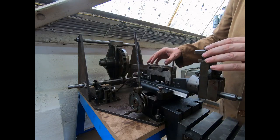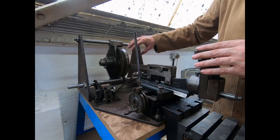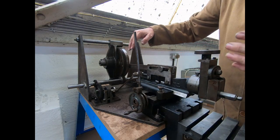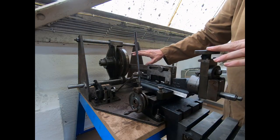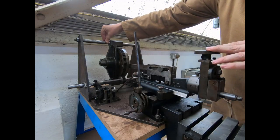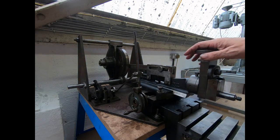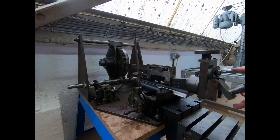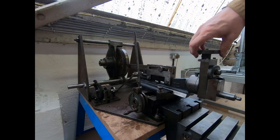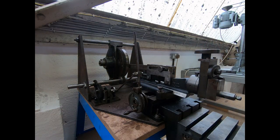That's effectively how it works. As this part moves across, it's sliding on these ways and making the whole rear mechanism move. Last week I had all this apart because it was seized up, and I've now got it moving fairly well — lots of potential to make further improvements. We've got the clapper box here as you would have on any other shaper, and you can move it up and down to adjust the height of cut.